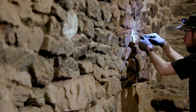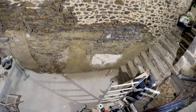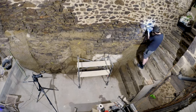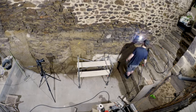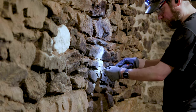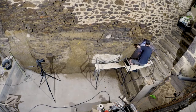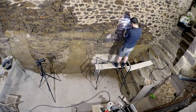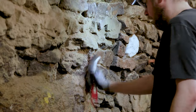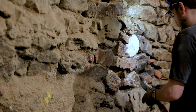And this is the way I'm cleaning the joints of the old mortar. I am using painter's knives, which I like because the blade is very fine, so I can go into very tiny crevices. And I'm scraping the mortar on all sides of the stones. I try to be very thorough because when you're applying your mortar and you're mushing it into old earth, it's not a very good feeling. Your mortar ends up being tainted by the color of the earth also. So I spend quite a lot of time to have a really nice joint before I can do the mortar.